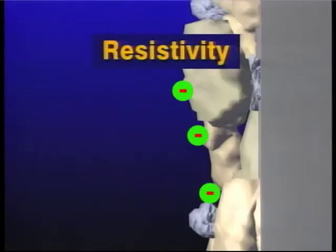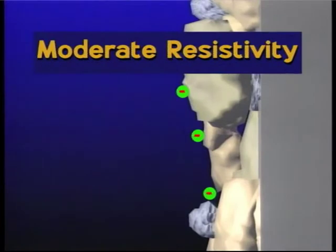The particle property that controls the deposition and removal of particles from the collection plates is the particle resistivity. Resistivity is the opposite of conductivity. The desirable situation is to have particles that conduct away some of their charge once they reach the plate, so that the deposition of other particles is not inhibited, but retain enough of their charge to lightly hold them to the plate. This characteristic is termed moderate resistivity.